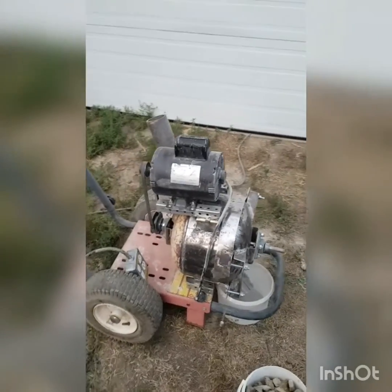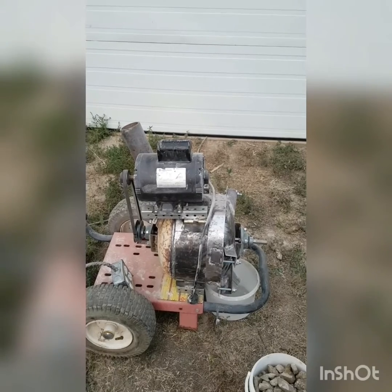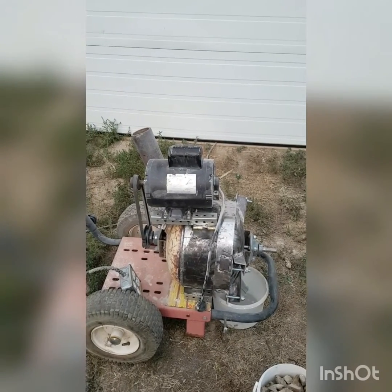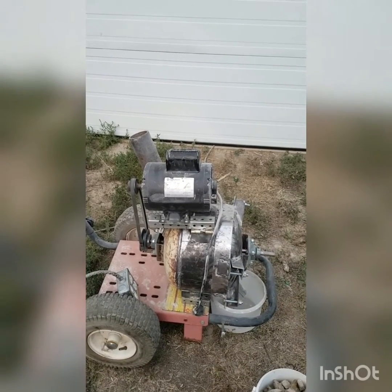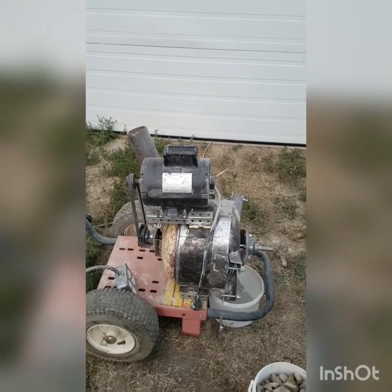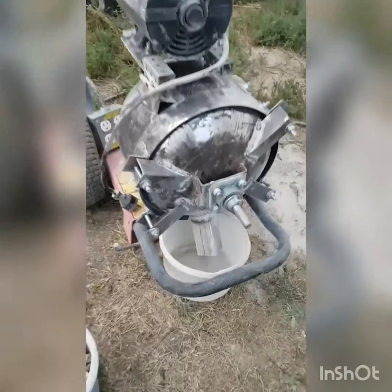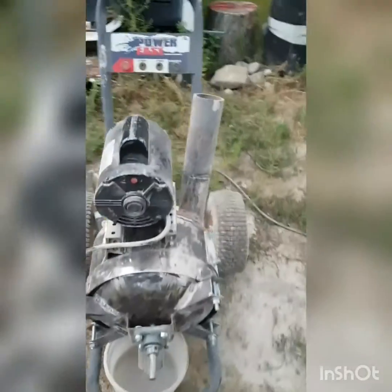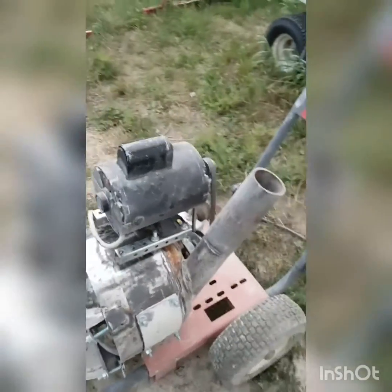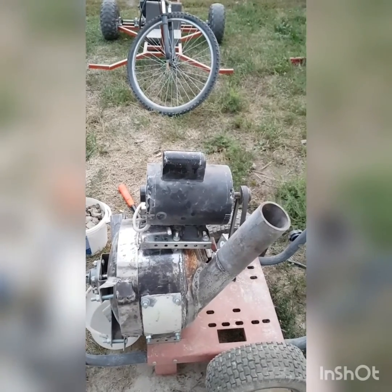I sliced the 20 pound propane bottle down — you can see it's a little bit shorter. There's a flange bearing on the front and back with a 5/8 shaft running through that I cut a slot in, and welded some 3/8 steel plate on either side of it. There's a chain flail in there. On the front here, going into the pail, you can see there's a square steel outlet pipe — that's where the rock dust comes out. And towards the back, we have our inlet tube that you drop the rocks in.